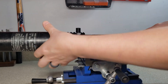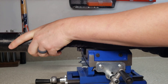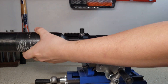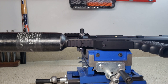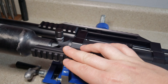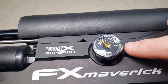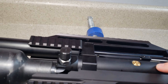I'm going to re-gas it — I won't screw the bottle all the way in since I'll be taking it off in just a second. Remember, we backed out a couple of turns on the first regulator but didn't touch the second, so the second is still fully adjusted out. Look at this regulator pressure — it's at about 70 bar. That's because the second regulator is fully open and it's the first one that's been brought down to 70.